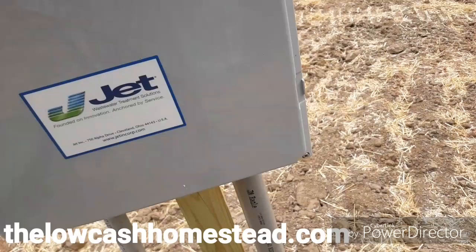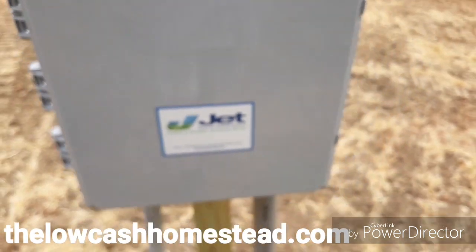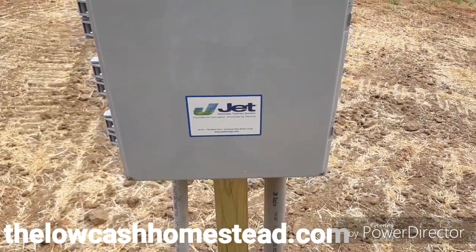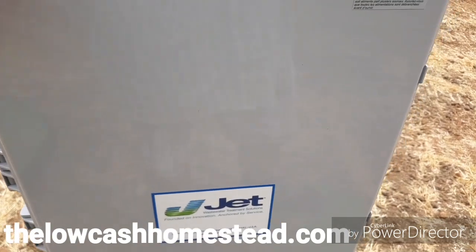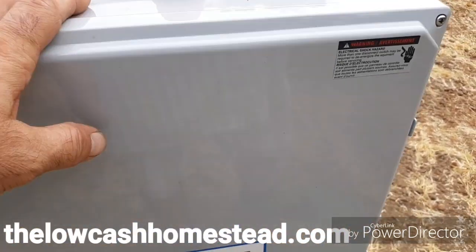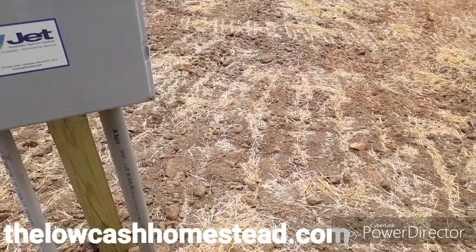Here we have our control system, which is screwed shut — I'm not going to open it right now — but it does have an audible alarm for high water. It's all mounted on a post. Inside the system it's timers, relays, breakers, and that sort of thing, so each component could be changed if there's a malfunction. It will not give intermittent alarming — once the audible goes off you can reset it, but this little light will stay on until the high water condition is cleared, meaning you've gotten some of the system pumped out. It pumps out every 15 minutes at a time, like every hour.